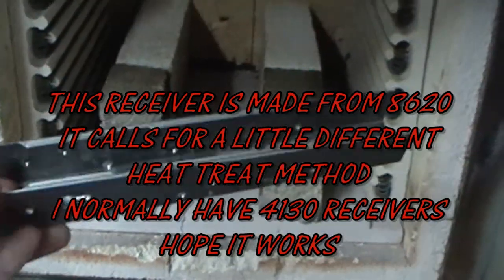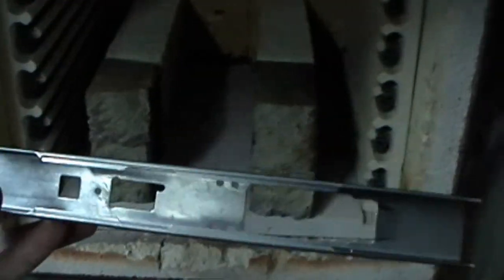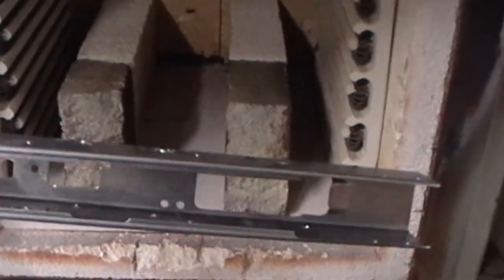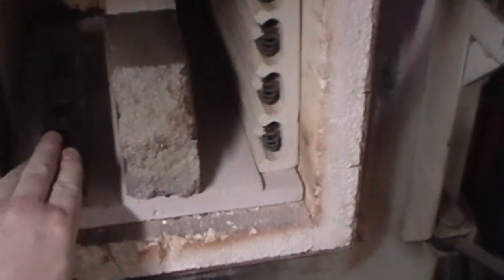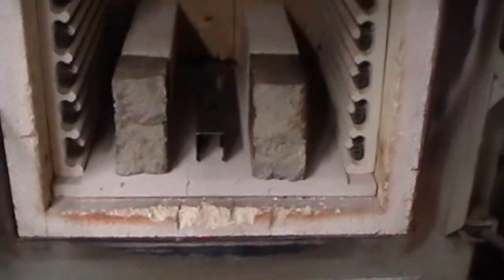You see it's our receiver — there's no rails welded in. I'll spot weld them in afterwards because this thing has a tendency to pucker. When you spot weld your rails in there, you see how thin the sheet metal is; put the rails in there and it becomes a lot thicker in that part and will warp, have a tendency to pucker in a little. We'll slide that in there when we're done heat treating it.